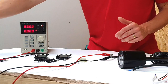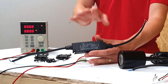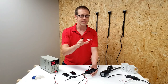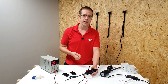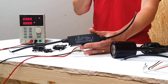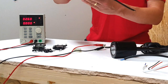Because the current flowing through the LEDs is so critical to the operation, the driver actually operates a bit like the ballast in a fluorescent light and manages the current through the LED. This can only be guaranteed if you connect the LEDs and the driver up correctly. Set them up wrong, and the current may be too high, reducing the life of the LED — and if you go way too high with the current, you'll destroy it. Even a small increase in current above the rated value can seriously shorten their operating life and even damage them pretty quickly.